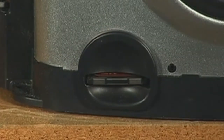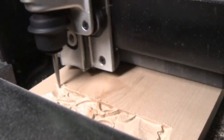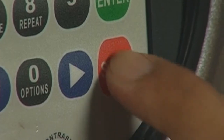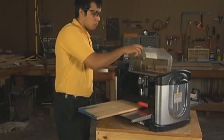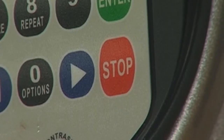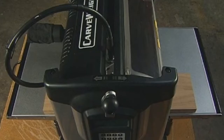Never remove the memory card from the machine while it is on. Irreparable damage can occur to the machine. To stop a project that is being carved, you may at any time press the stop button or lift the safety cover. This will command the machine to stop all motion. Pressing the stop button a second time will abort the project, so be careful when stopping the machine's operation.